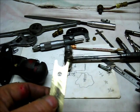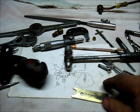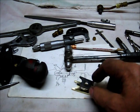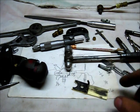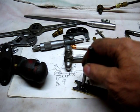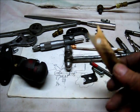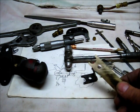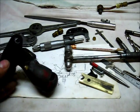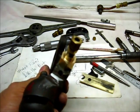In order to get that hole in there, I just laid that thing down and put this thing right on top of it like that. Then took a punch and put it right in the center, made a little punch mark, went over there and drilled the hole in it. We're to this point now - the next step is this thing will be just like that.